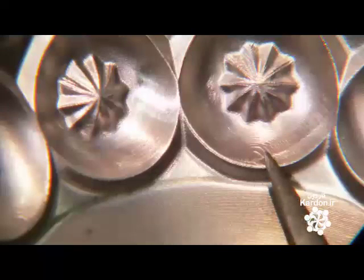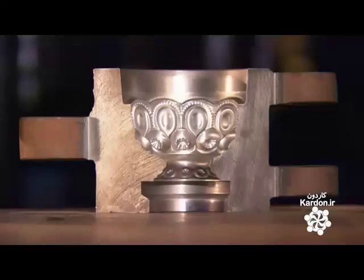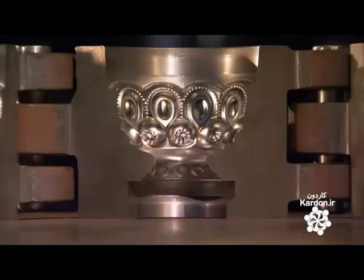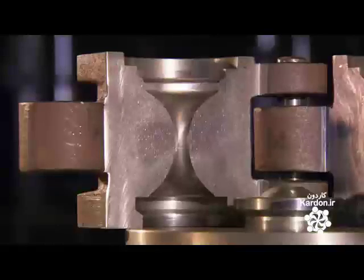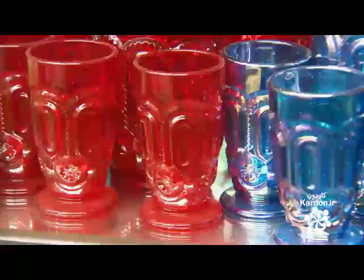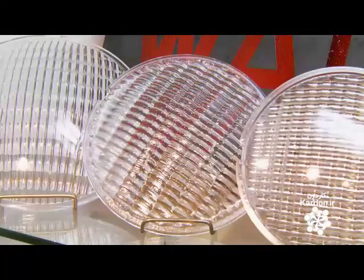On the right, you can see the marks, and on the left, the smooth, polished surface. The sections are now ready to be assembled with pins into a complete mold. When it's time to pour in the molten glass, the pins enable the sections to close and interlock. Once the glass cools and solidifies, the pins make it easier to open the mold to extract the casting. Glass artisans and glass manufacturers alike use handcrafted molds to produce a wide variety of glass items, from functional to fancy.